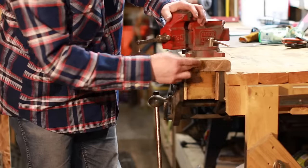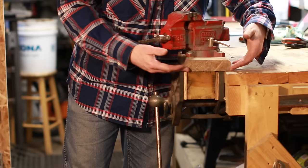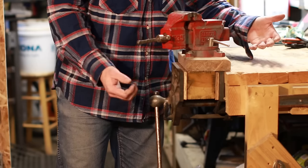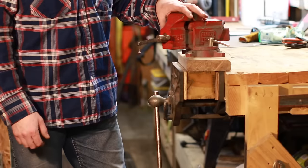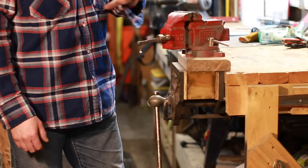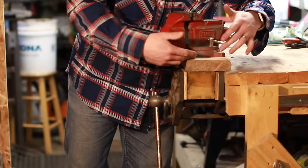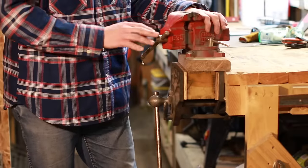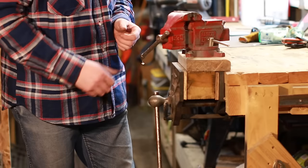What I've done is screw a piece of 2x6 to a 4x4 — that gives me a lip to rest on while I clamp it down. I've got another small swivel vise on there, and this is where I do all my handle scale glue-ups. You can probably see there's epoxy dripped everywhere — this vise is strictly for clamping my knives when gluing up the scales.